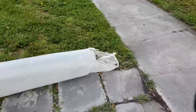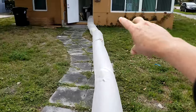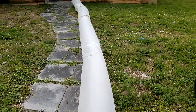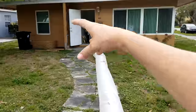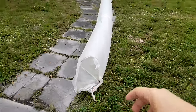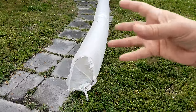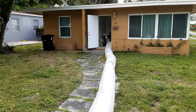That shows how much dust was inside that house. So when he's spraying the bathtub, you're going to see a big mist of that. All of the overspray and stuff will come out of here. So that fan in there, that vacuum fan, is going to be drawing it all out here, because you don't want it floating around inside the house. And that's why we turn off the air conditioner as well, so that none of the paint or anything gets sucked up into the filters or onto the coil of the air conditioner.